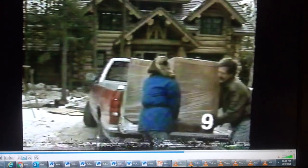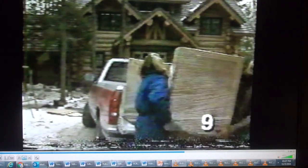I'm all done upstairs. Now let's go. I went ahead and installed our 2x4 nailer here to bring the height of our base cabinet up to what will become the height of our finished floor. The frame of the cabinet we're installing here will form a 90-degree angle with the cabinet underneath the window, so we ordered it with an extended base frame to form that joint. Now we want to shim our cabinets up to the level line that we drew here earlier.